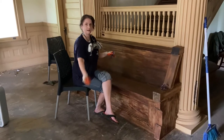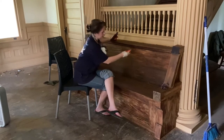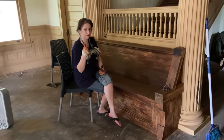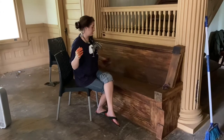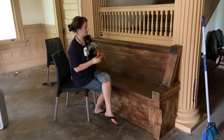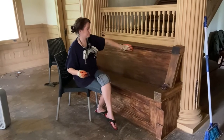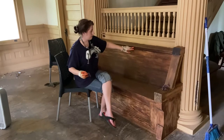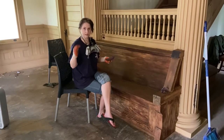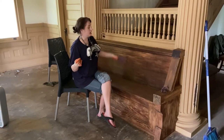You're going to need a little pick. We've literally been going over this entire thing getting out all these little white marks with a pick — and that's the only way. The speed heater did a great job of lifting the initial layers, but the speed heater has some limitations in these cracks. I'm going to play with it a little more to see if I can get it more efficient in these areas, but I almost think that an old-fashioned piece of sandpaper, a pick, and a chisel are going to be about your only options here.